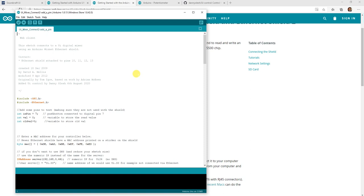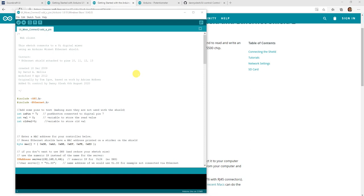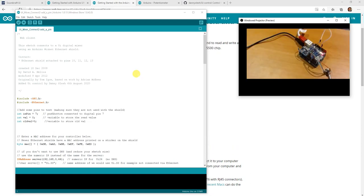So now what I'm going to do is the same code as before, just with a little addition — we are adding a pin. Right here I'm adding a pin on pin 7. I've got a 10k resistor as a pull-down to ground, and another wire connected from pin 7 that I can connect to ground to turn it on or off. You can't just leave it floating, because then it won't know exactly zero or one depending on what's going on with RF and EMC around there — the pin would float, and that's not what we want.